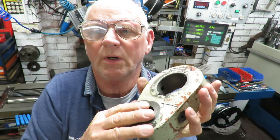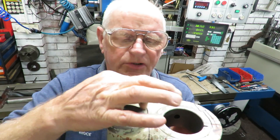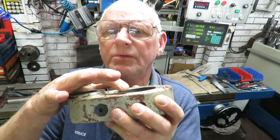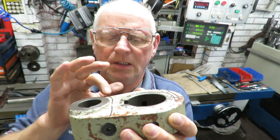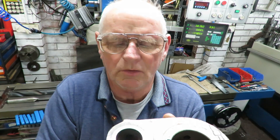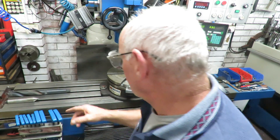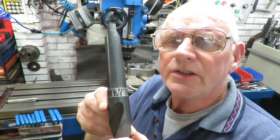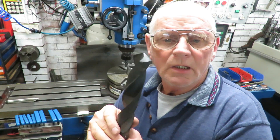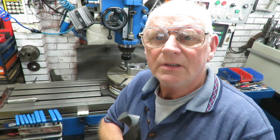I've started with this one and set it up on the rotary table with this one in centre and started to machine around. I'll machine down to that thickness - actually I'll come down to this boss thickness here and then maybe cut a little bit more afterwards. I've centred the table, and in order to get this in position I've used that 35 millimetre hole. I didn't have a 35mm drill, but what I had was an inch and three-eighths drill which is almost identical. So that fits in the taper centre hole of the table, and I use that to centre up and clamp down the part.